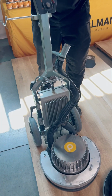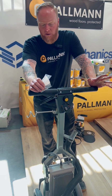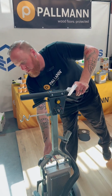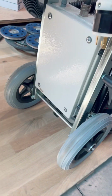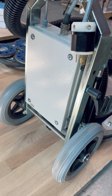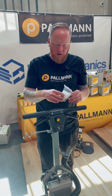If for whatever reason the machine's being run too high, too low, or there's a power surge, it could blow one of these fuses. There are 4 screws on the back of the box, very easy to remove. There's going to be a replacement fuse inside along with the other fuse. Make sure you turn the machine off and unplug it if you go inside the box.